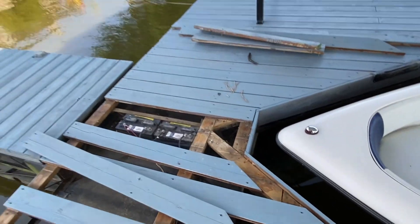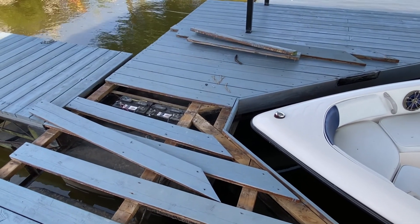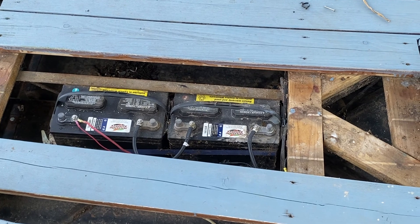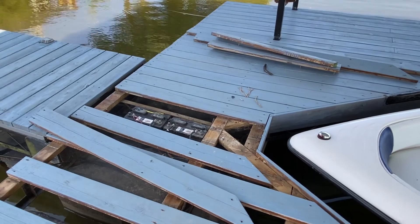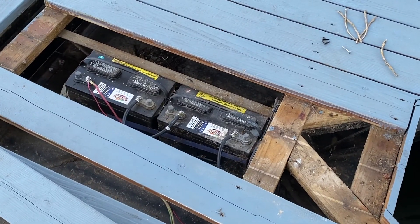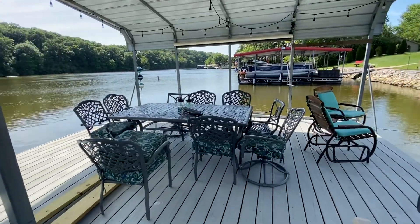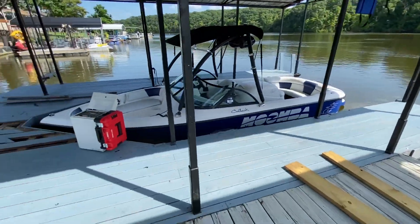Eventually the customer wants to add power to this whole thing — they want AC power, so we're going to be going back and replacing these batteries with some brand new ones, either new AGM deep cycle batteries or gel. It's outside in the elements, so lithium is not really an option — it takes power to heat those batteries and we don't want to burn more power just keeping them warm. Eventually they're going to have a ceiling fan, lights, and everything else. We're going to do as much DC as possible, but they want AC power as well.